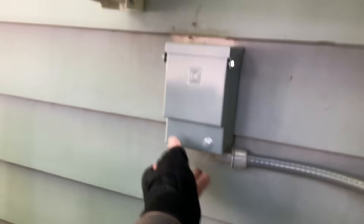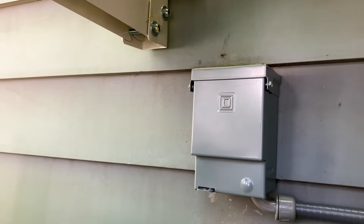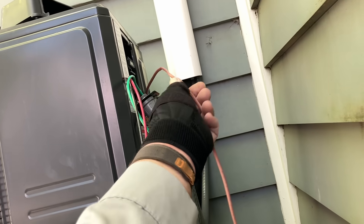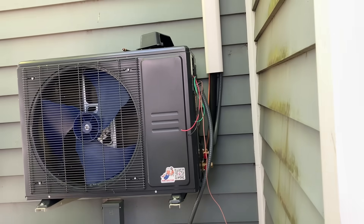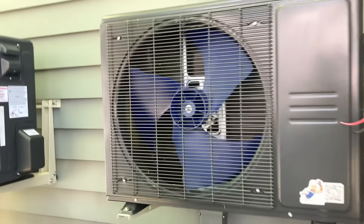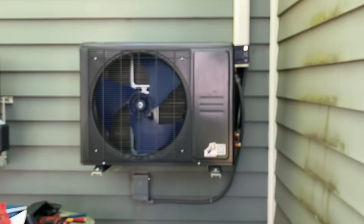I have my disconnect box — this is a non-load-rated disconnect panel with the breaker in there, which is just a glorified on-off switch. I've got a piece of half-inch liquid tight. I'm going to strap that with a PVC strap. I've also got liquid tight on my low-voltage connection for the communicating wire. Mike's got the ICM 518 — we're going to wire that to the outdoor unit, drill a hole with my step bit, and wire it in parallel to my L1 and L2 connection so the outdoor condensing unit will be surge protected.